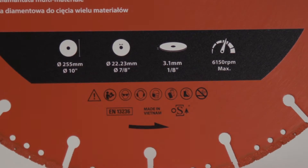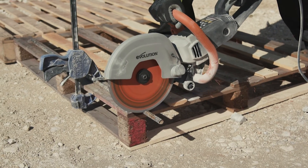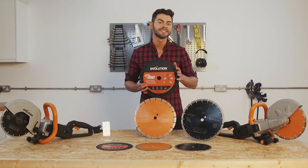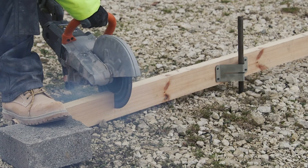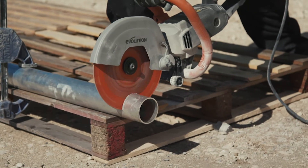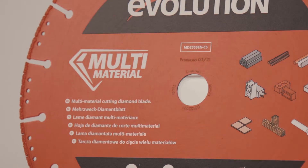The multi-material diamond blade offers versatile cutting on a range of materials. When cutting metal, it has a much higher blade life compared to abrasive discs, and it maintains full cut depth through the entire life of the blade. It emits less dust particles than abrasives and is ideal for cutting wood like concrete shuttering, iron, manhole grates, aluminium drain piping, plastic ground piping, and much more. Cooling holes close to the edge help expel heat, which maintains optimum cutting performance. Heavily concentrated diamonds give a coarser cutting edge compared with standard diamond blades.